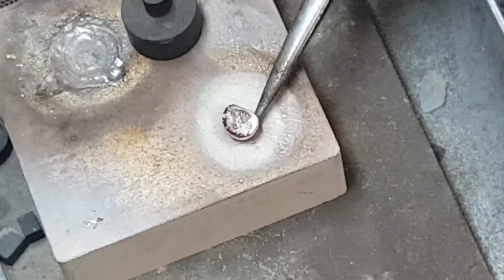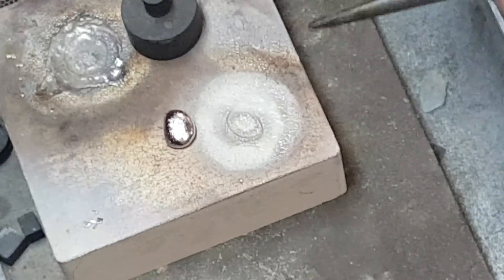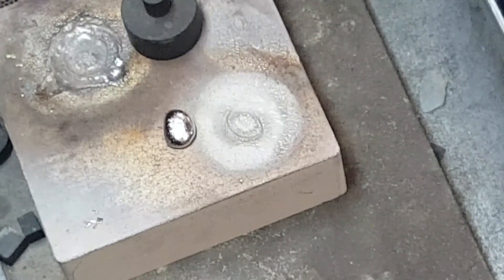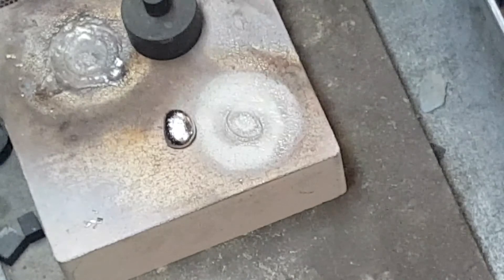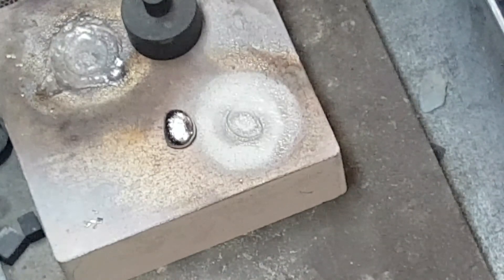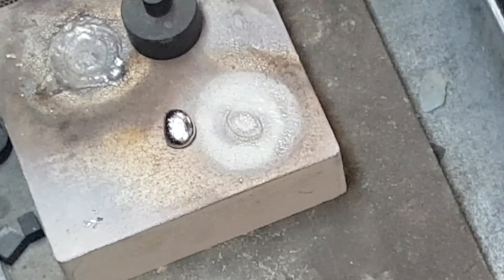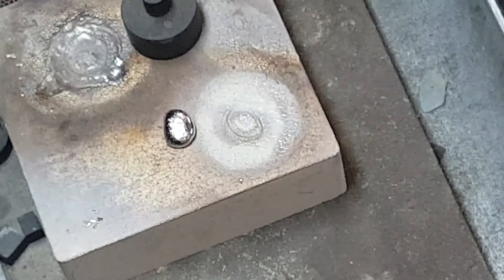That's ready to roll after all the ceramic from the crucible is off it. The reason you get rid of that is so you don't damage your rollers as you roll it through — you'll damage your plate and your rollers if you do it too much. So it's always good to have clean metal. I'll air cool this, put it in the acid for as long as it takes to remove any flux or ceramic from the surface, then go through the rollers. I'll call that part two. Please subscribe if you liked the video — if there's anything you want to see, write it in the comments below and I'll do my best to make a video for it.